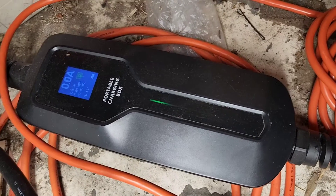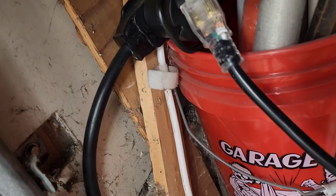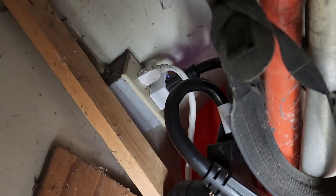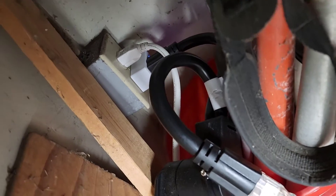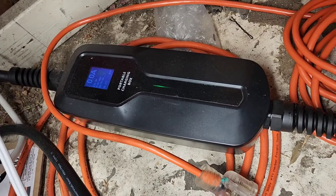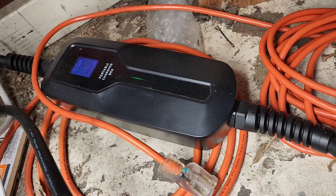Here's how I have the charger plugged in. We have this big charger brick - you can see it's not charging anything right now, showing zero. This wire goes up to a NEMA 14-50 adapter, and this adapter splits into two things. The one below is a smart switch. There are two smart switches - one here connects to that, the other goes to an extension cable running down here. It's a 14-gauge 30-foot wire, which is required for an EV extension because it can handle 15 amps no problem. I only charge at 15 amps and don't go higher because I don't want the cables to overheat.